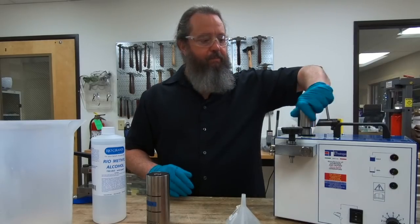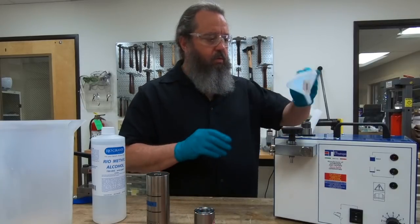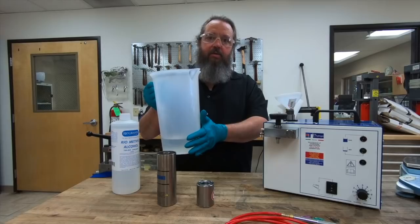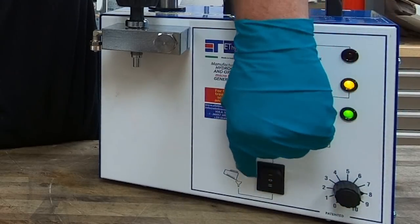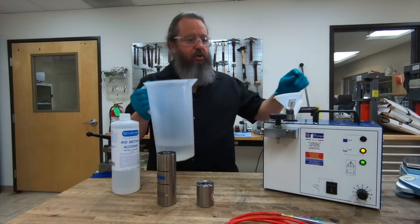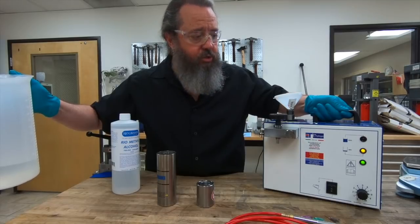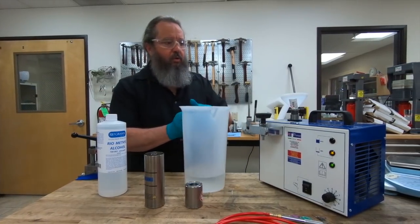We need to remove the safety cap — this is the cap on top of the tank that we're going to pour our electrolyte solution into. Use the funnel that came with the machine. The electrolyte solution has been about an hour and has cooled down. You never want to put recently mixed electrolyte solution into the machine until it has cooled down. Turn the machine on and put it into the second position — you can see there is a funnel along with a pitcher icon. On this side, you're going to see green lights and a yellow light that show you the fill level in the tank.